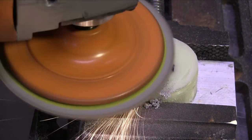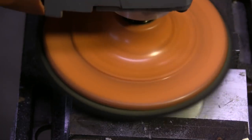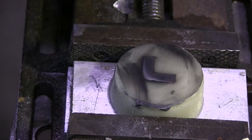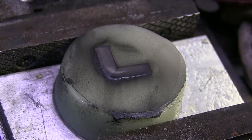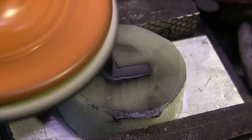I'm starting off with a 120 grit flap disc and gradually working down finer and finer grit, until finally using a cloth with sort of a polishing compound at the very end to get it to pretty much a mirror finish.